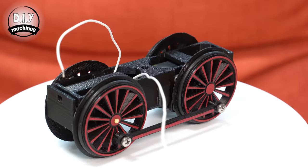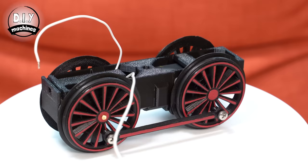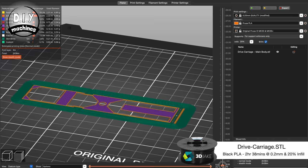You can set this aside for a little while and we'll start to work on the drive carriage, which is the part of our model that will propel our train forwards. Once printed, we can use the drive carriage's handy cutting guide — which I have incorporated inside this 3D print — to help you cut 7 lengths of your brass rod to approximately 39mm. Once we've done that, this print carries on to be incorporated into the train.